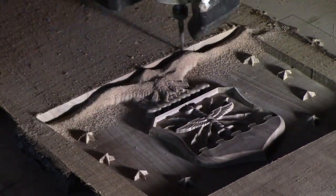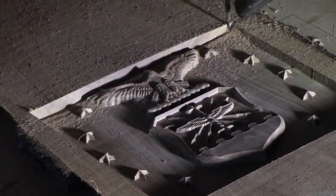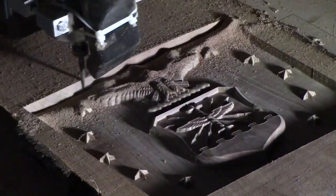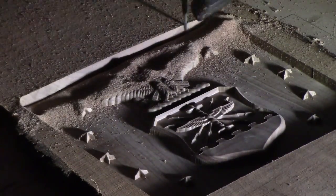It's on black walnut. I'm carving it at a hundred millimeters per minute feed rate and a 50 millimeter per minute plunge rate. It's a one millimeter bit, and it's just about wore out — I'll be changing it on the next model.